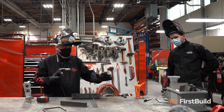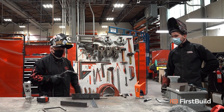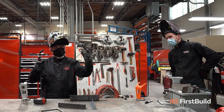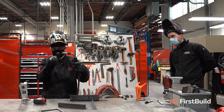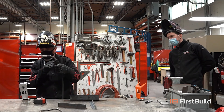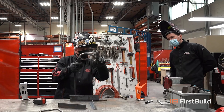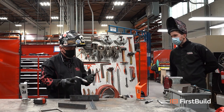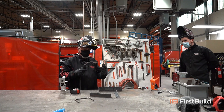All right, we're getting ready to weld. I've got my clamp on the table. Let's talk a little bit about technique. Colin, are you a pusher or a puller? I'm a puller. I'm going to start my weld bead on this side, lay the gun over, and walk from left to right. Pushers run the gun the other direction — they're always looking at where they're going, not where they've been. I don't like pushing because if I'm not doing a good job, I won't know until I'm done. When I'm pulling, I can actually see what I've created and follow the joint. Do whichever way is comfortable, but I'm going to drag as I go.